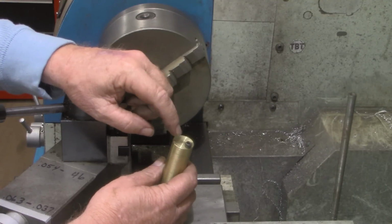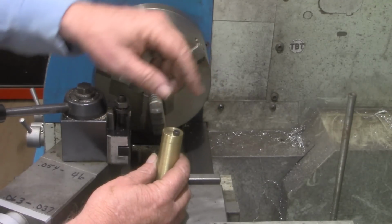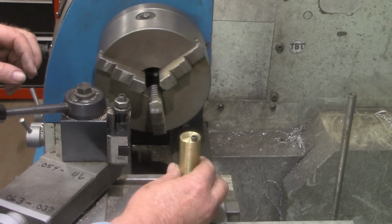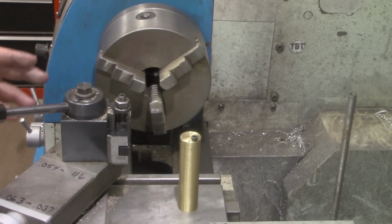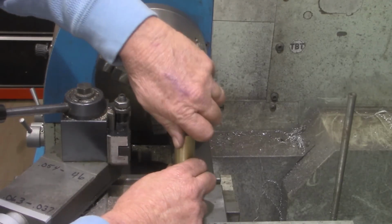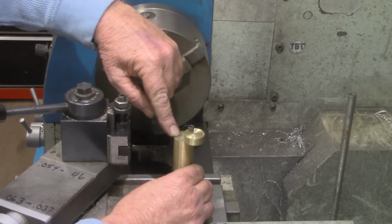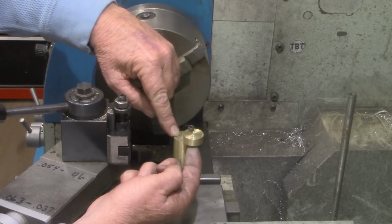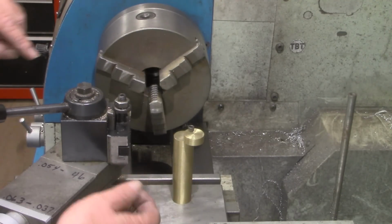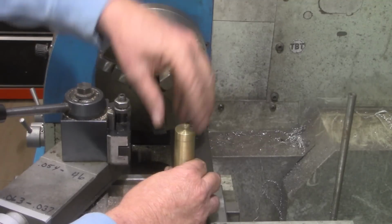Okay, over at the workbench, I drilled out the threads in what we're calling the cap here so that it pivots easily over this 10-24 screw. Now, if you haven't figured out what we're doing so far, here's the way this will work. This will set on the cross slide down here and kick out. Now the top of this is within, I suspect, a half a thousandth, 5/10 of the bottom of that. I can always tighten that screw down as I'm setting up. This is for storage.